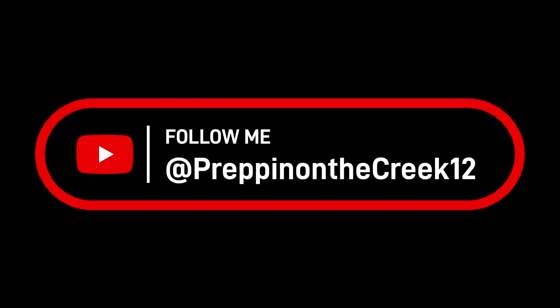Now what are the things I don't like about it? I don't like the SAE connectors — not a big fan of those because you've got to have those polarity reversers. MC4 is the most common connector and I would have even preferred an Anderson connector on the end, because you can go from Anderson to MC4 pretty easily. On my battery I've got Anderson, so I could have just plugged it right in instead of having to go Anderson to SAE to a polarity reverser back to this SAE connector. That's the main dislike. Other than that, I think it's a good little unit for the price — you can't really beat it for an MPPT charge controller.